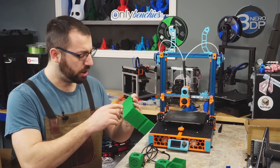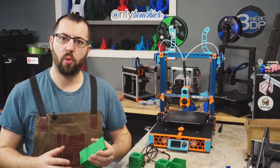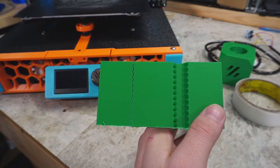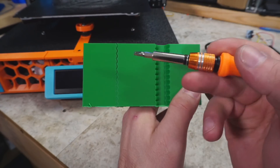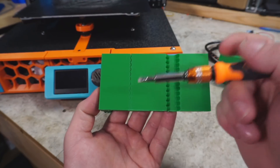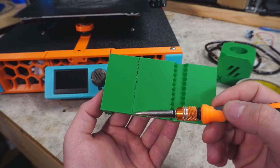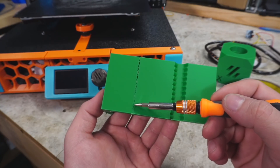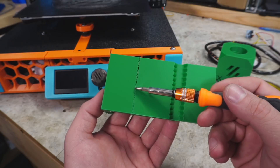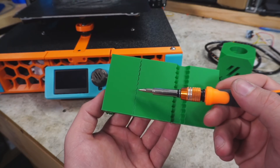What you're going to be looking at is the portion with these curves, and where the gap widens — that's the point where your acceleration is starting to get too much. Know that when you start you're at 1250 millimeters per second squared and each band is an additional 500 millimeters per second squared of acceleration. Measure from the bottom to the point where you start seeing gaps, count the full bands that are good, and stop once you get to a band that has a gap.